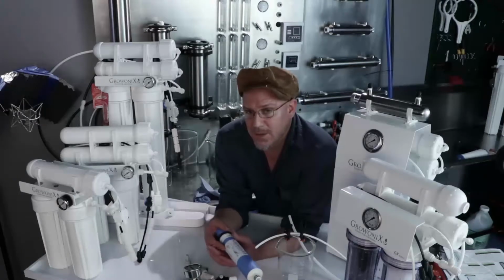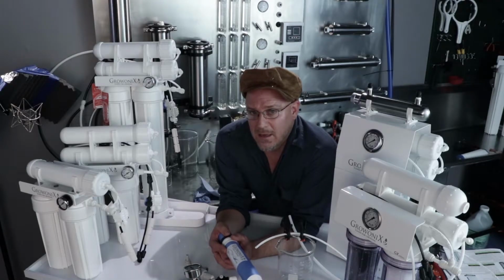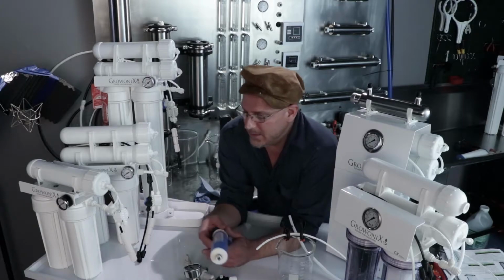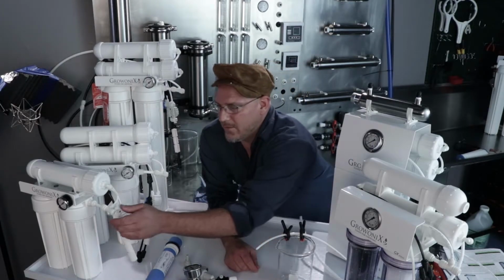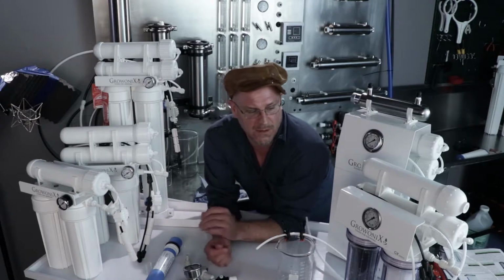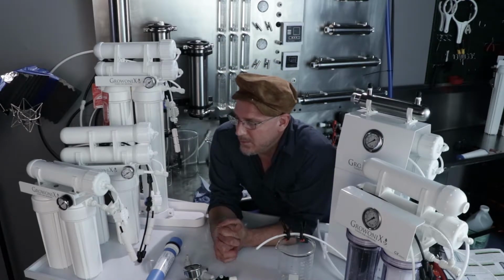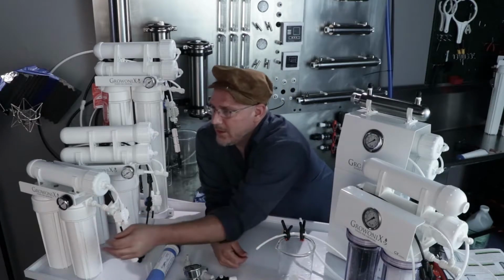This video is about pressure regulators. There are people out there who have too much water pressure. Now, the input of all of these smaller RO systems, 400 gallons a day and under, the input canisters are only rated at 80 psi. They can handle a consistent 80 psi, but you shouldn't go over 80.